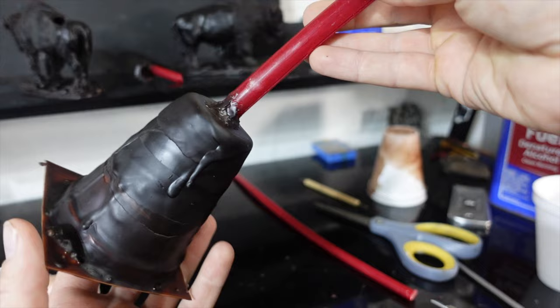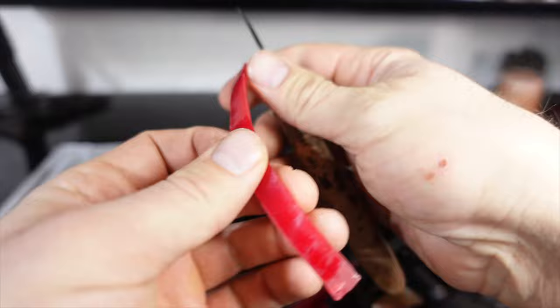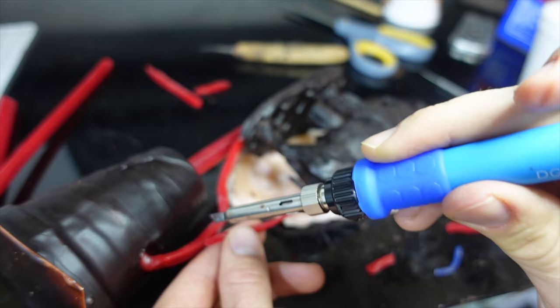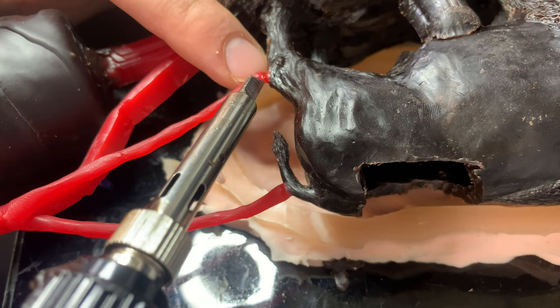I want to make sure it's fused together very well, and then I'll attach it to the sculpture. When I need smaller vents, I'll just cut a bigger sprue into quarters. I don't want air to escape the same hole that metal is flowing into. So like the bloodstream, I want a circulatory system where metal goes in one way and air flows out another.